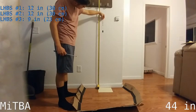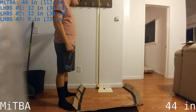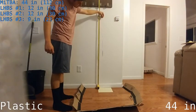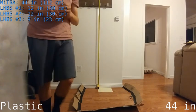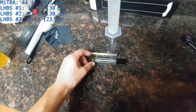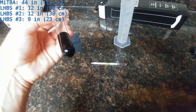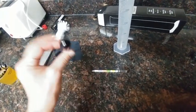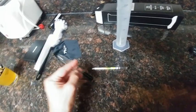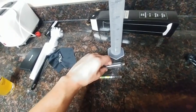The MITBA was dropped from 44 inches before it broke — bouncing off the neck — just a crack from 26.5 inches on the plastic one. At the end of the day, it's plastic so it's not going to shatter. I'm actually pretty impressed with the resilience of the MITBA. I think it's because the weight in the bottom is fully coated in epoxy, whereas the regular homebrew store ones had loose beads of weight at the bottom with epoxy only on top — no solid backing. The glass also appears a bit thicker based on the sound.